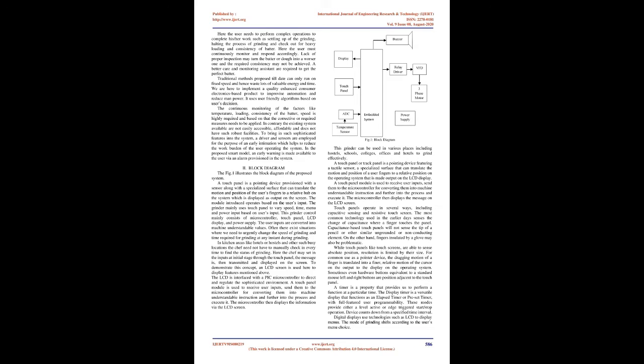8. The techniques referred from these papers lag in efficiency and user-friendliness in operation. The proposed model has improved performance and is simple in operation. Variable frequency drive and quarter HP motor are among the most important parts of the system. VFD is an adaptable speed drive used in a driver system to control the speed and torque of an AC motor by varying motor input frequency and voltage.